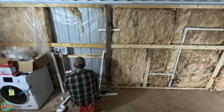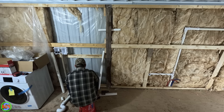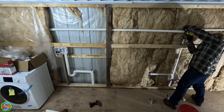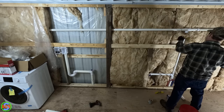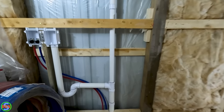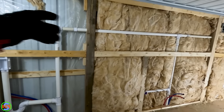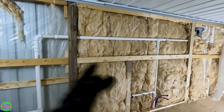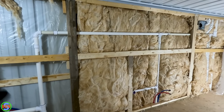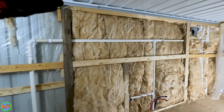We'll throw this time-lapse in here showing me assembling these fittings — taking our time priming each fitting properly, gluing each fitting, pushing them together, double-checking our lengths, making sure things are level and pitched properly. With all residential plumbing indoors, you're going to be looking at a quarter inch per foot for your fall. On a longer distance, you can measure how long the pipe run is — every four feet you drop one inch. Between there and there is eight feet, so in that span we drop two inches.